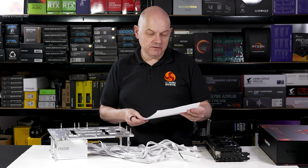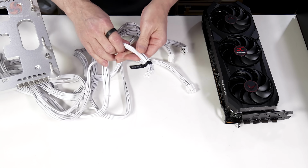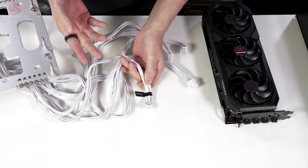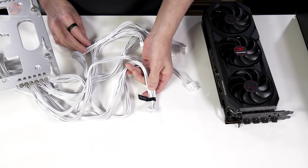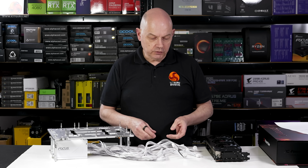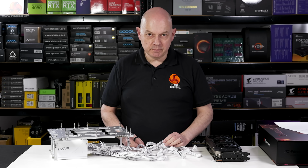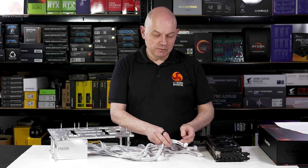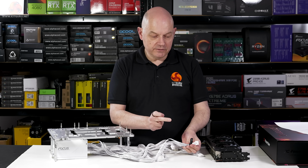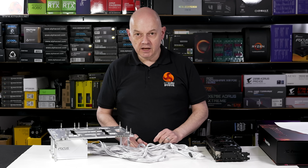and the RTX 5090 600 watts. In other words, a single 12 volt 2x6 connector has essentially no safety margin whatsoever. Now we know they do build in some extra on top of the nominal 600 watts, but we're into tiny handfuls of percentages. It makes sense to me for RTX 5090 to have two of these connectors, and then the 5080 and 5070 can have one.